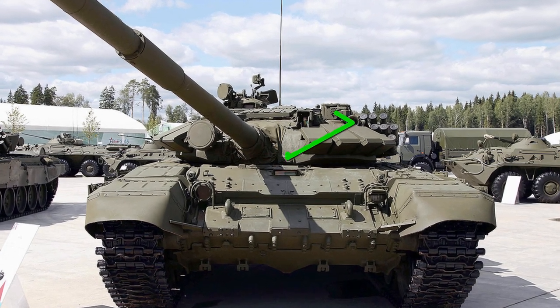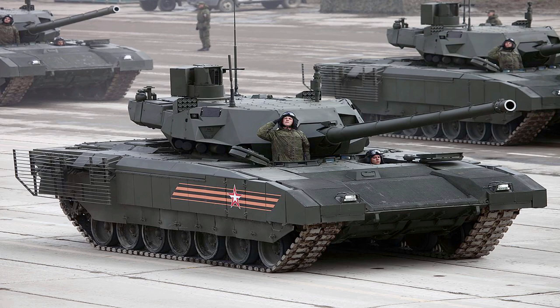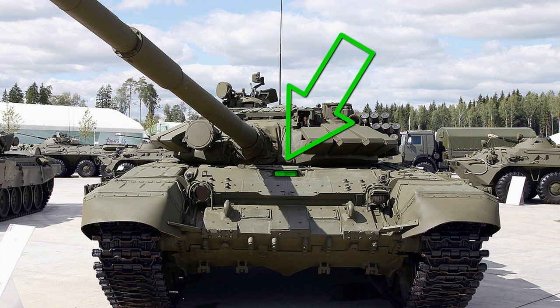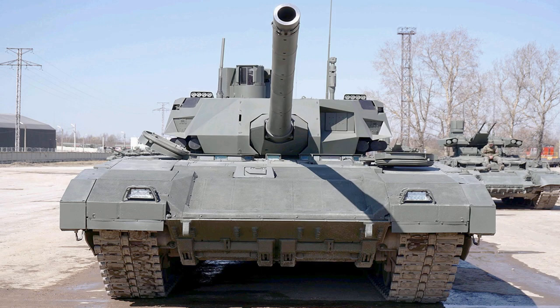The second tip is the driver's periscope or periscopes, located at the front of the vehicle. Tank variants used or that can be used in the conflict in Ukraine have one or three periscopes. If at the front of the driver's hatch we see one periscope, it is the T-64, T-72, or T-90. If three are visible, it is a T-80 or T-84. In the case of the T-14, as the entire crew — commander, gunner, and driver — are in the front part of the hull, we have two hatches in the hull with three periscopes each, and additionally one periscope between these hatches for the gunner.